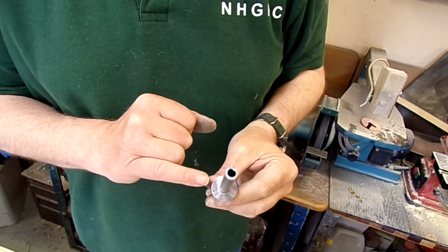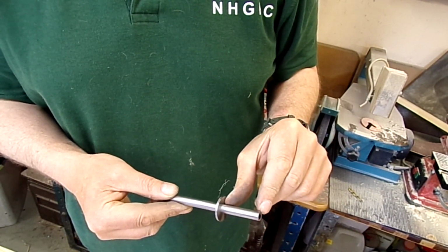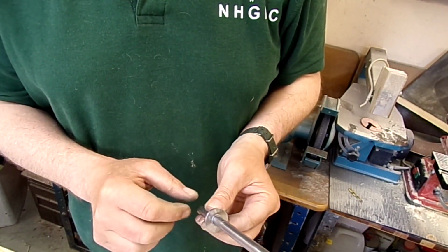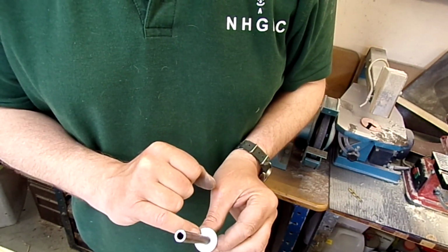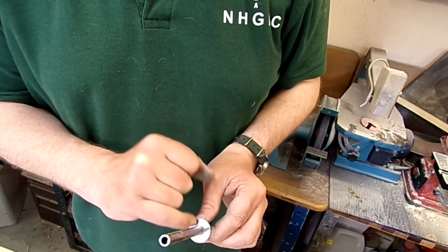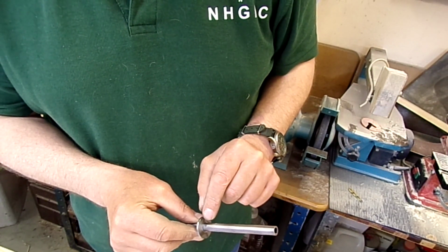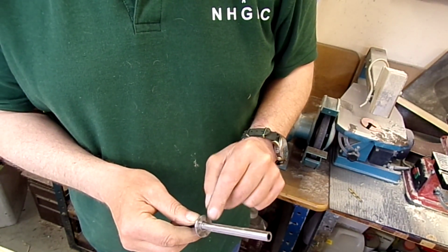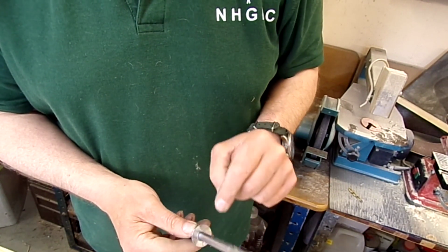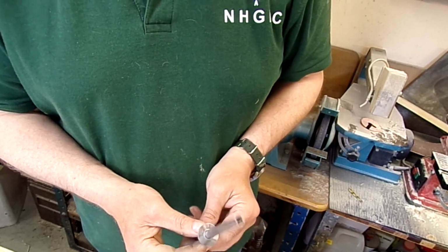Okay, so the washers, these have been pressed on. So I've got the 43.2 millimeters from there to there to account for the rubbers on the engine mount. Because they're that close to fit, hence the requirement for the counterbore and the countersink in the back there, so we can get the weld right into that corner in the bottom there, and then this will be built up so it'll have quite a nice little fillet of weld going all the way around. Quite a high amperage to make sure I've got good penetration into the tube and into the washer, but not so much that I burn through.